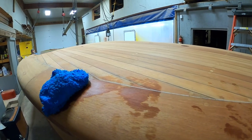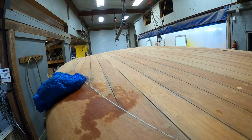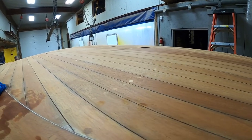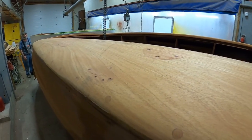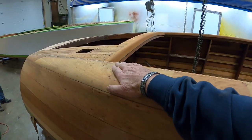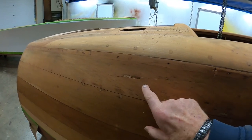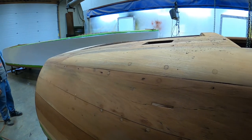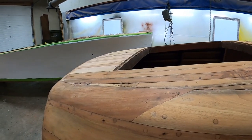Happily, on the foredeck, other than seams needing to be cleaned out, the foredeck is just superb — down tight, no broken screws, nobody has been mucking about replacing pieces of wood. Her foredeck is going to be stunning. Once we replace these panels and get everything sanded fair on the covering boards, decks, and sides, and attend to a few failed Dutchman repairs others attempted, she'll be in great shape. She's at least stripped to bare wood and we can begin making her beautiful.